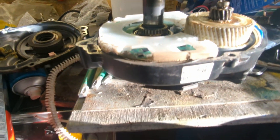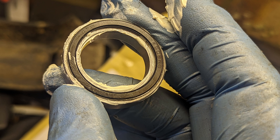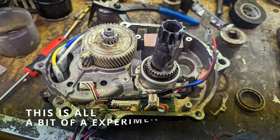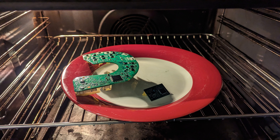Anyway, this is fixable — I'll order some new sealed bearings and we'll be back on the road. To improve the waterproofness of the motor, I packed the bearings full of marine grease so there were no voids; this acts as a barrier since the water goes through the bearings. I then removed the circuit board, cleaned it with brake cleaner, and coated it with multiple thick coats of conformal coating — a waterproof lacquer — placing it in the oven between each coat at 30 degrees for around 15 minutes. I also coated the bottom part of the circuit board in silicone grease.